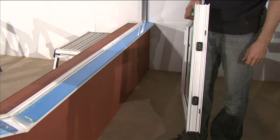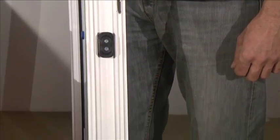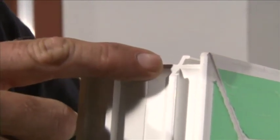Select the panel to fit against the property wall. Ensure that the drainage slots in every panel are located at the bottom of the panel and facing the outside of the conservatory. You'll notice that each panel corner has the inner legs on the panel detailed and notched away. It's essential that this detail is present to ensure that all 18mm inline couplings can slide into position.